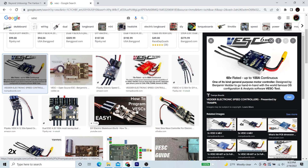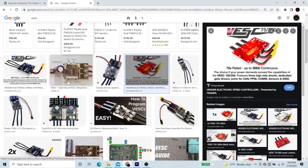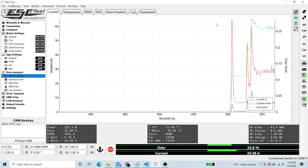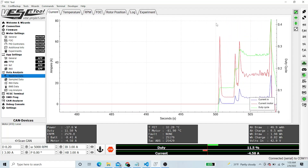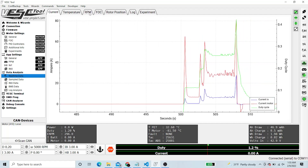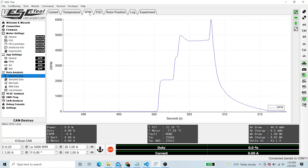The first step to building this device was to test the motor, and to do that I needed a motor controller. I was poking around a makerspace and found an old VESC that wasn't being used anymore. A VESC is a very customizable, programmable motor controller for brushless motors. I hooked it up to this brushless motor, and lo and behold, no life — it kind of just jittered around. I found that some of the wires that were supposed to be soldered correctly from the factory weren't, so I had to re-solder all those. I plugged it back into the VESC and the motor fired up and started running perfectly.